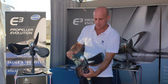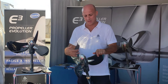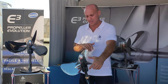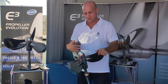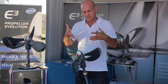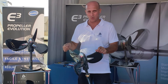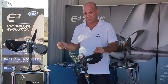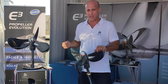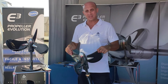In addition to these characteristics, the Energymatic has an internal mechanism that sets the feathering position automatically. You can see it comes back to the feathering position by itself because of an internal spring. You no longer need to turn off the engine and put it in reverse — simply removing the forward torque lets the blades return to the feathering position.